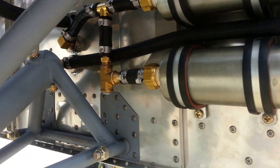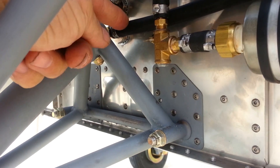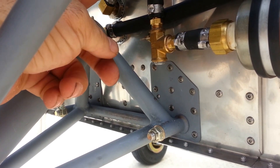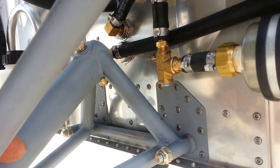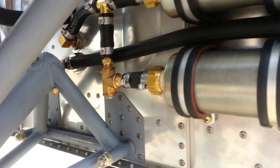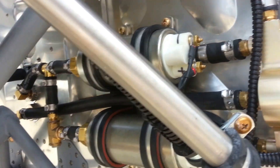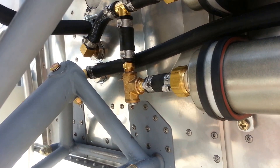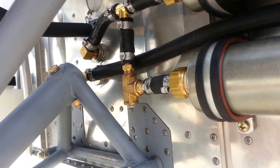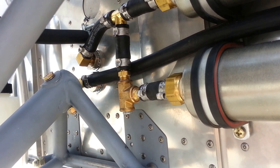On the feed end of the pumps — the low-pressure side going to the pumps — we'll put a little bit of fire sleeve to keep them insulated from the heat in the engine compartment. You don't see any filters at the inlets of the pumps because we're going to rely on the filters and strainers that are in the tanks.